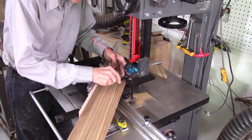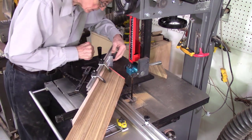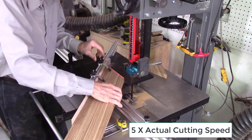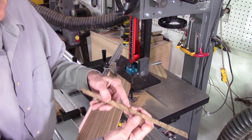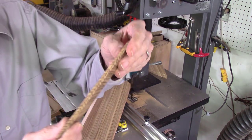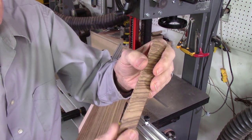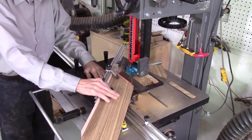I'll start off by cutting some strips about an eighth of an inch wide. I want to cut a bunch of strips the same thickness so I can use my stop to set my thickness — all my boards will be exactly the same thickness. Here are my first two strips, which could be glued together back to back to make a long strip, or like this to make my herringbone pattern, or just a single strip to make a rope pattern. As a double strip it would be about a quarter of an inch wide — just about the right thickness, and then I'll put accent strips on the outside.